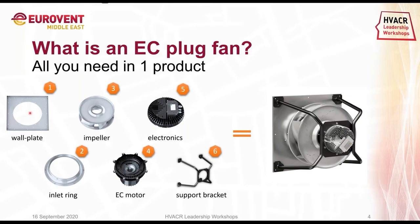It is at first the wall plate, which we use for mounting the fan into the application. We use the inlet ring to make sure that we efficiently get the air into the fan. Next to that, we use the impeller and we mount the EC motor on the impeller. I will dive into the EC motor in the next slide. We add some electronics to make sure that we can let the fan run, of course. And at last, we use the support bracket to keep everything together so that we can supply one complete fan to our customers.